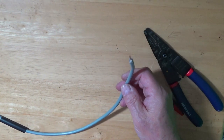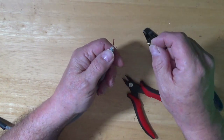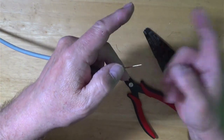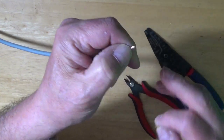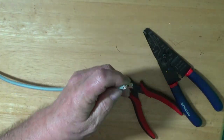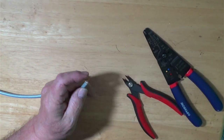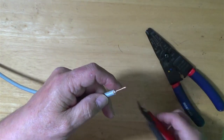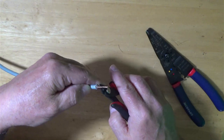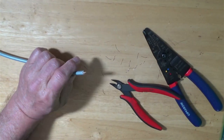Now, all of these crimp ends as you buy them could be marginally different - that's why you see me comparing a lot of things. I am actually going to put this on here way up at the top like that, and I'm going to put my thumb to where it comes down so I can see the length of that, because that is actually important. I need to put that end on right down here at the very end. I am going to take my little cutters and cut it to be about the same length.